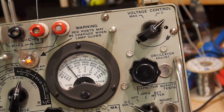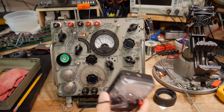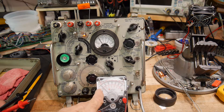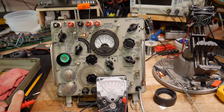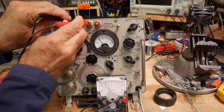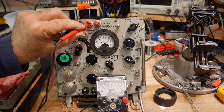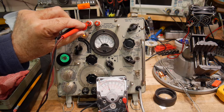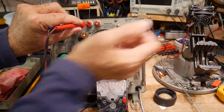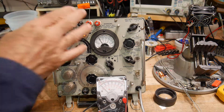Let's see if that's really true. Let me zoom out here a bit — sorry for the camera work. Let's use my Triplett meter. My Triplett meter is set to zero to 300 volts full range. If I go across the capacitor here, we're reading about 90 volts. We could make that a little more accurate. That's about 100 volts. Yeah, the meter is about 100 volts, so it's about right. We are getting 100 volts on the capacitor.